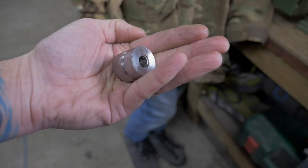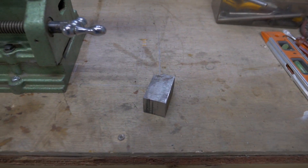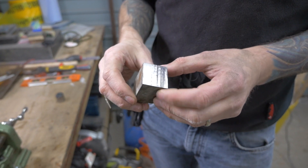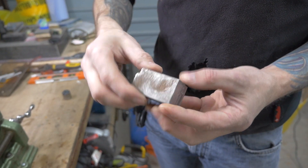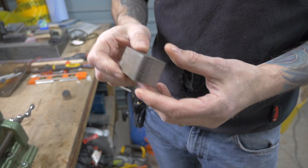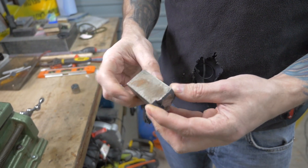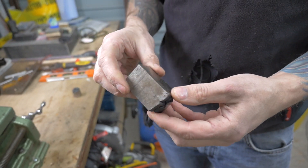I'm going to talk you through what I'm going to do and then we'll get Mini D-Breeze and I onto the lathe. We're going to turn the Damascus after we've smoothed it out a little bit, then we're going to measure our fingers, make rings, put them into the ferric chloride, and actually turn them into rings. Our chuck on the lathe is a three jaw chuck — if it was four it would be perfect, but it's three. So I'm going to edge over some of the corners on our grinder so the chuck holds it really nicely, then we'll start turning down to get two rings out of it. Let's get onto the grinder first.